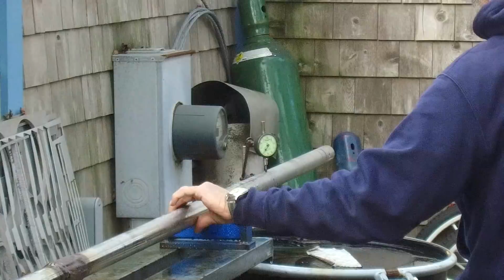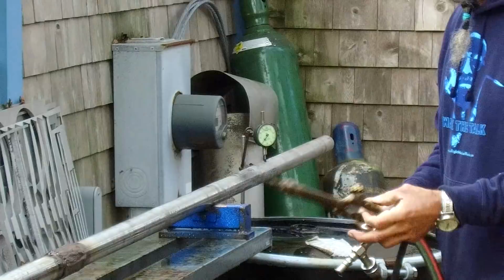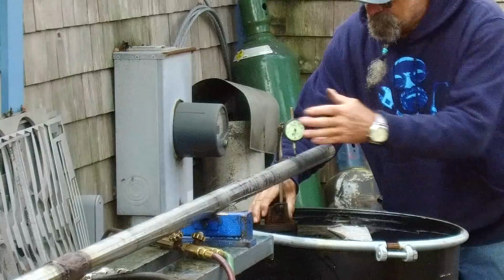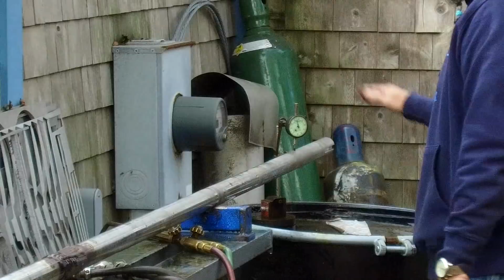Okay, I'm running 1,000 right there. Okay, so on that 8, that circumference where that 8 is going to be where I'm going to make my adjustment for the next position out here. Okay, we had 18 here. Now we want to see what's left. We have 4. That shows you that by correcting what was in here, because that was a progressive bend in somewhat the same line or same alignment of the axis there.